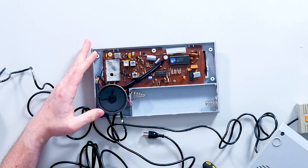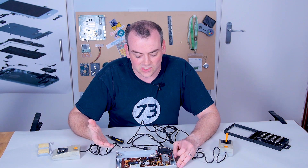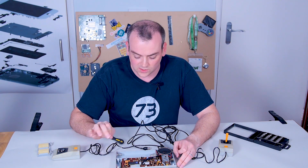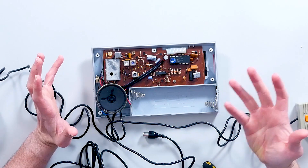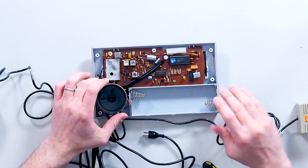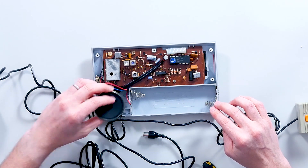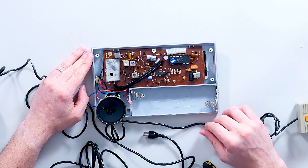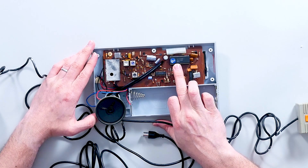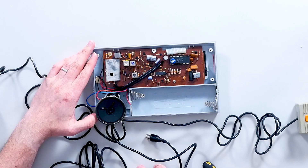Very simple board. In the instructions they give details that when you tune the telly you have to turn the volume right down. I hadn't appreciated that meant none of the sound actually comes out of the telly - it all comes out of the speaker on board, which makes the RF modulation a lot simpler. Again, I guess it's just driving down the cost. Otherwise, lots of passives. This chip down here, the AY38610, will be the Pong on a chip device.